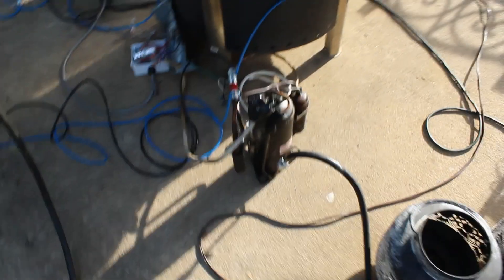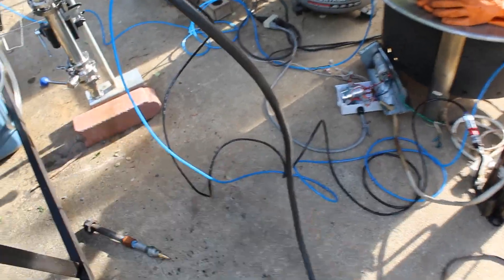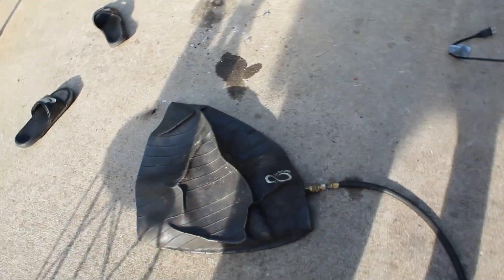See how deflated this ball is. What I have here is this pump - a vacuum pump from a window AC unit. Right now the vacuum side, we just vacuumed out all the air of the machine. But what's going to happen is when we turn the machine on, we're not going to turn on this pump right away, because no vapors form until the machine starts to get hot and up to temperature. We're going to turn that pump on once the machine gets a little bit hotter, once some real vapors start forming.